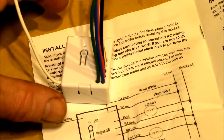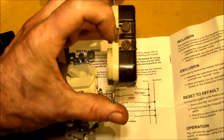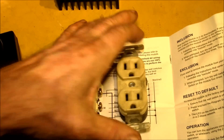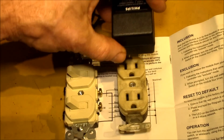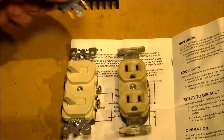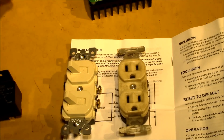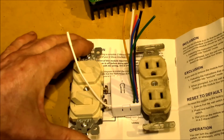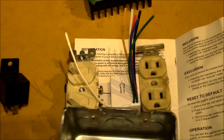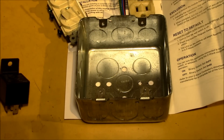The green and blue wires are for switches, so I get two switches and two outlets. What I need to do is break the connection on the hot side so there are two independent outlet receptacles, then I can plug one wall supply one way and one the other way, and control two relays which can control two converters. This one little box in the middle picks up its signals wirelessly.